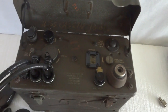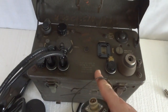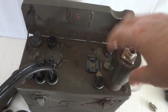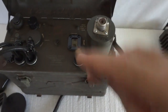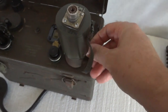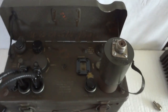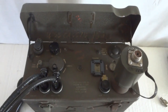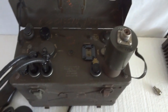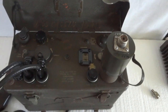Now, how we're going to make this radio work is a bit of a challenge. I have what's called a TM-217. If you look in the manual for this radio — which can be downloaded from the internet — you'll see what it's for. It's for using an external antenna. It screws into the antenna socket here; the socket was designed for high-impedance whip antennas, and this little device brings that down to 50 ohms. I also ground this strap, which allows me to use my external antenna. At 48 megahertz it's a yagi, and that lets me reach the other station about five miles away.